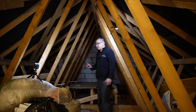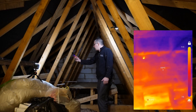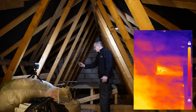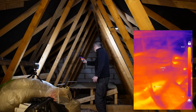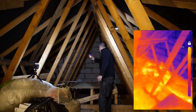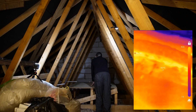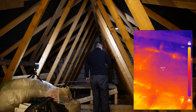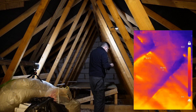Okay, that's a very quick job for the moment, but I think that'll do. That's almost two rolls of insulation, so I'm going to have a quick scan around with the camera now to look for hotspots. You can clearly see a little gap there where there's single insulation, but there's a beam there that I need to be able to stand on in case I need to get to different parts of the loft — so I've kind of got to sacrifice a little bit of heat loss for convenience. There's probably a better job needed over there because that's where the vents run for the ensuite. You can clearly see the difference between two layers and one layer of insulation, with a few little heat spots coming through.